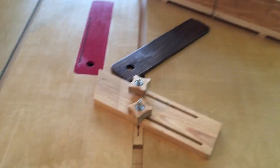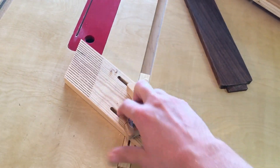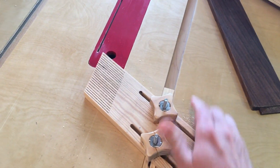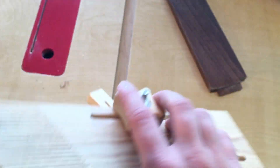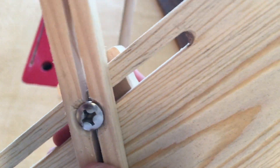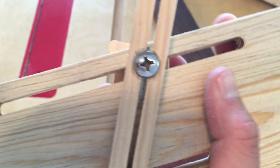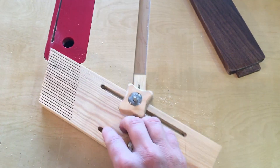I'll probably put some drawers on the sides to hold different stuff. I made this featherboard — I'll put a link in the description for how I figured that out. Basically just made some knobs and a featherboard. The biggest challenge was right here: I needed to figure out a way that when I was spinning my knobs and tightening them, these nuts wouldn't spin. What you can see is I drilled through that bolt and just put a little pin in there to go into that slot so it would not spin.